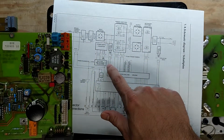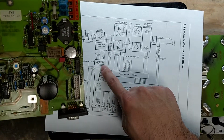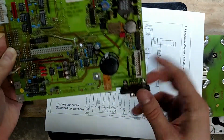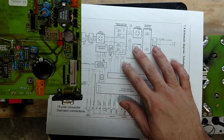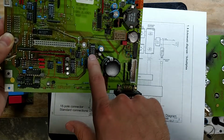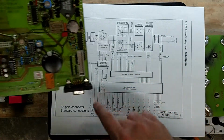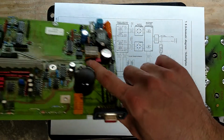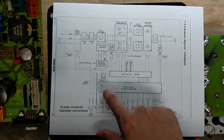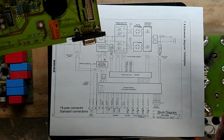And then we end up with the rectifier and everything, and 12 volts out ends up going on this capacitor here, becomes the main 12 volt supply. And then this 5 volt regulator is this chip right here. It's an adjustable regulator. It's set for 5 volts. And then we go into the assorted relays and things like that. There's one buried underneath here for these guys, for that one and this one. And that's it for this board for now. We're going to come back to it later.